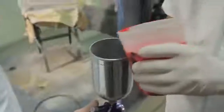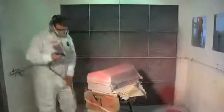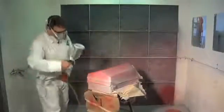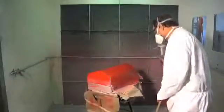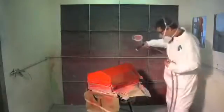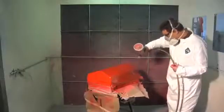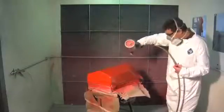You can apply the top coat through the same gun that you used to spray the primer. However, use lower pressure and set the fan for a finer spray. The first coat should be a fine coat, a dust coat — you should still be able to see the primer through the surface. After the dust coat is applied, wait at least two minutes and then begin the build coats with the Duratec Top Coat. Each build coat should be four to five mils, and it's necessary to build at least 20 mils to get good cure. Wait at least two minutes between each wet pass for solvent to release. It's good practice to do the first wet pass in one direction and then the next pass in a 90-degree opposed direction. This makes sure the Duratec is evenly distributed with no thick spots and no thin spots.